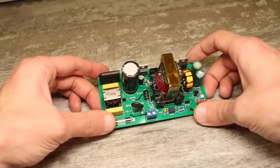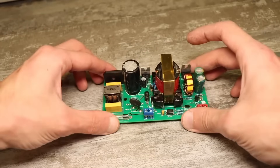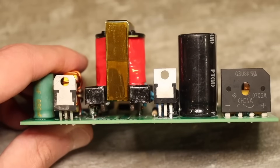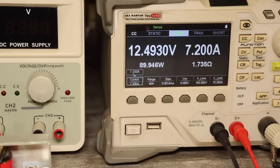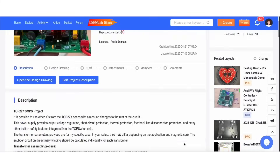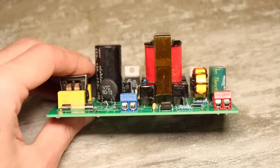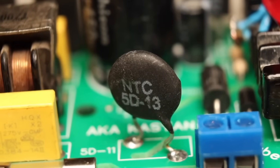I won't be showing the output voltage ripple, since in this particular case no measures have been taken to minimize it, because these units will mostly be used in chargers together with voltage regulators, and ripple isn't especially important for charging. Of course, you can always add more capacitors to the output, an external filter, and so on, which will sharply reduce the ripple. The power supply is finished and works great, so it's time to wrap things up. You'll find a link to download the full project archive, as well as the project page — including the PCB, schematic, and other details — in the description. Don't forget to rate this video with a like or dislike, and share it with your friends on social media. That kind of support is truly invaluable. And with that, I'll say goodbye. As always, this was Kazinov K. See you next time!